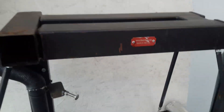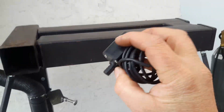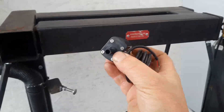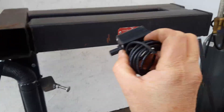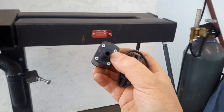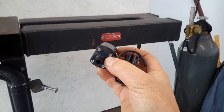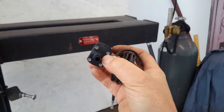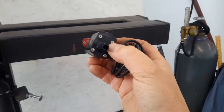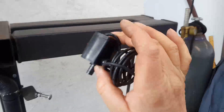To go with that, we have sourced these wonderful little DC brushless centrifugal circulator pumps. The nice thing about the brushless DC centrifugal is there are very few bearings or moving parts. They use liquid plain bearings — the pump rides on a cushion of water and nothing touches, there are no brushes. These have an extremely long lifespan.